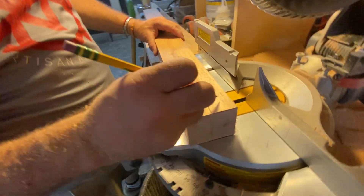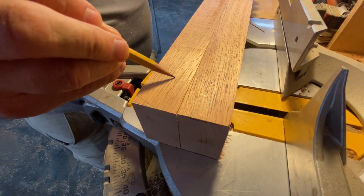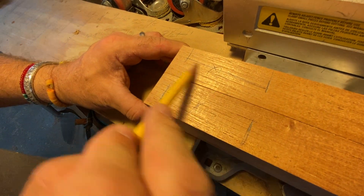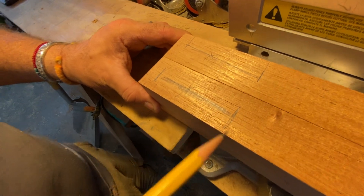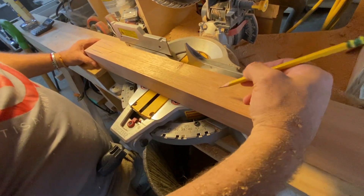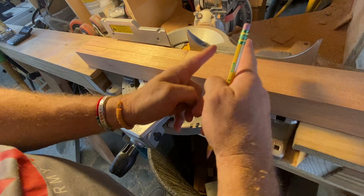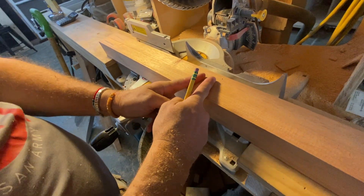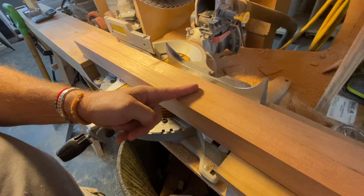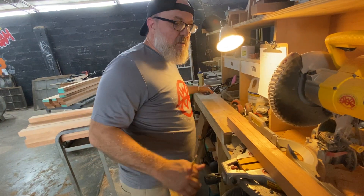So this is my mortise hole for my meeting rail. I'm going to put a mortise there, take the wood out there. I've got this mortise here, and I'm going to mortise from line to line. Somewhere in the middle here, I've got to put my hole for the center mortise, and there's going to be a space missing there. The distance between the edge of this space and that hole, and the edge of that space and the other hole — those need to be the same.